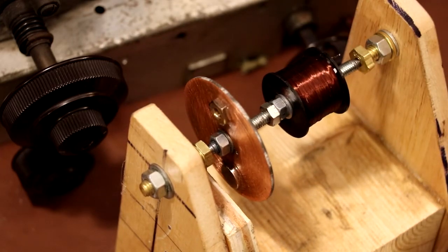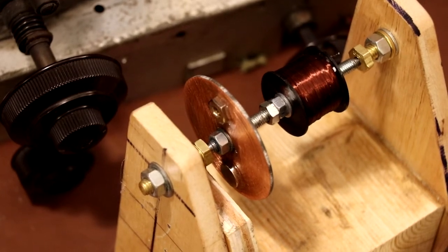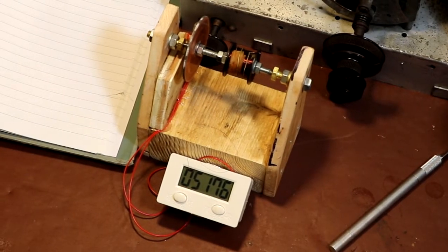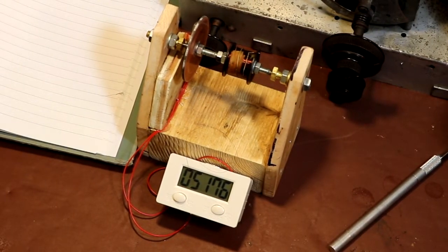So I do think that this wire has got multiple breaks in it, and there, we've just hit one of them. That's annoying. So with 5,176 turns in, we've hit the, what do you call it, the centre tap? I'm not sure. It's not actually in the centre of the auto transformer. It's actually towards one end. So it makes me think that if that was about 5,000 windings, I suspect we've probably got another 10,000 until we've unwound it all together.